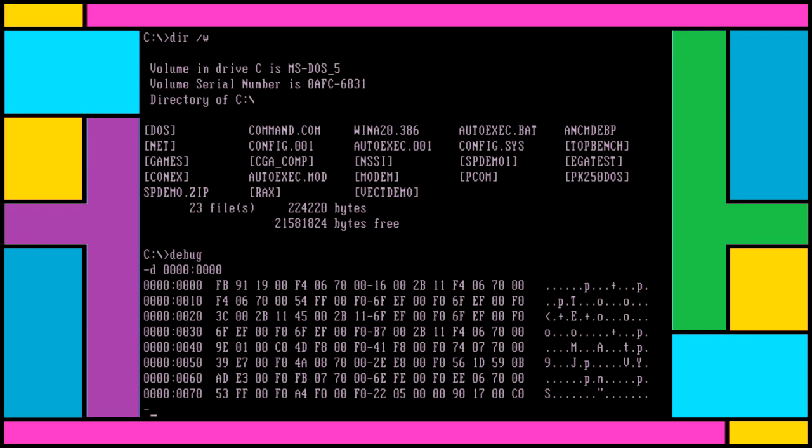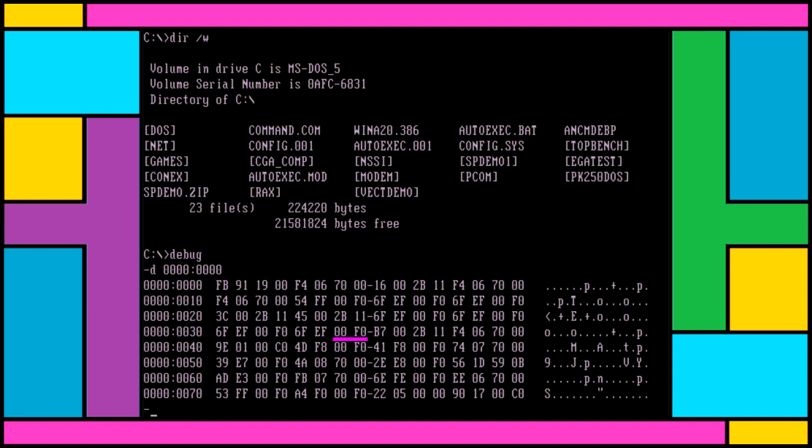The one thing I did find interesting looking in there is actually where you can see the video cards. You can see the C000 reading right to left for the VGA card on my 286 versus the F000 on the XT, and the reason being that the CGA card and monochrome cards don't have their own BIOS chip, whereas the VGA card does, and so obviously that ROM has to exist somewhere in memory, and, well, that's C000. You can also see below where the drive controller host adapters are hooking, where that's different. That doesn't make sense how that's F0, it really shouldn't be, so I'm not sure what it's doing.